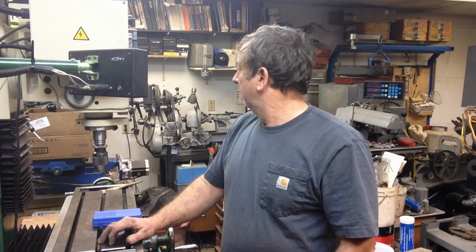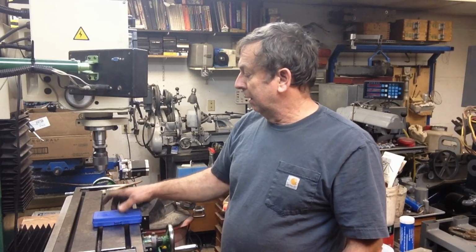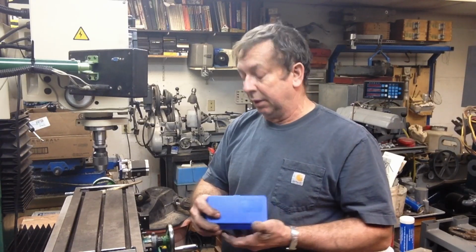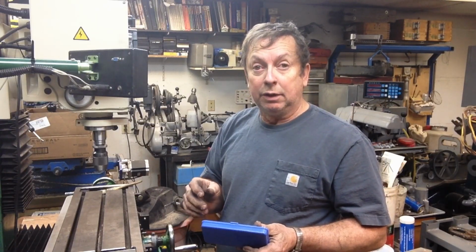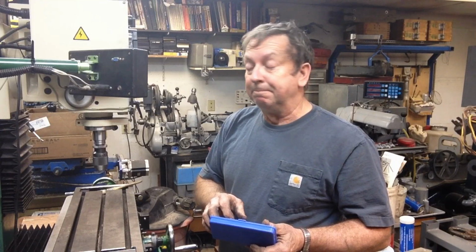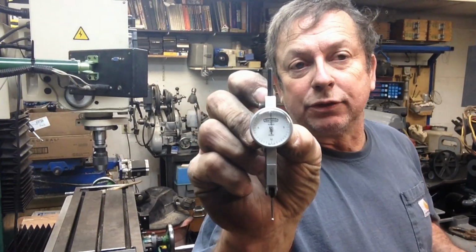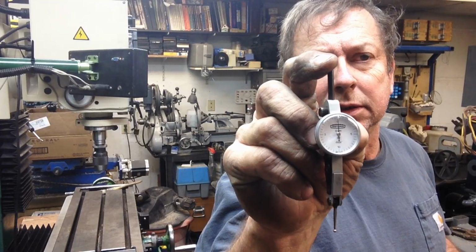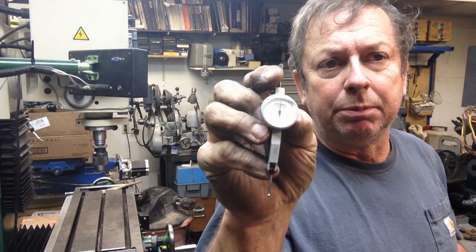And I did pick up a little eBay purchase, a little dial indicator off of eBay. I'm going to set this up on the Sheldon lathe. I'm going to dedicate it to the outboard end of the spindle. A lot of times I'll run things through the headstock, and I indicate them both on the chuck end and on the outboard end. And I'm going to dedicate this little dial indicator to it, a little Craftsman, made in Britain. I've got another one of these that I like for a whole lot of things, and this one's actually in better shape than the one that I've already got.